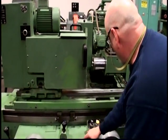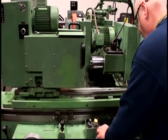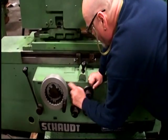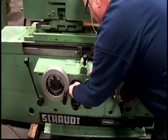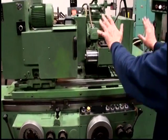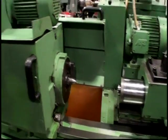For ID grinding, this is the point where you would block the machine from ever going back, keeping it forward — you have to block it from going to the rear. Here is the jog control for the headstock.